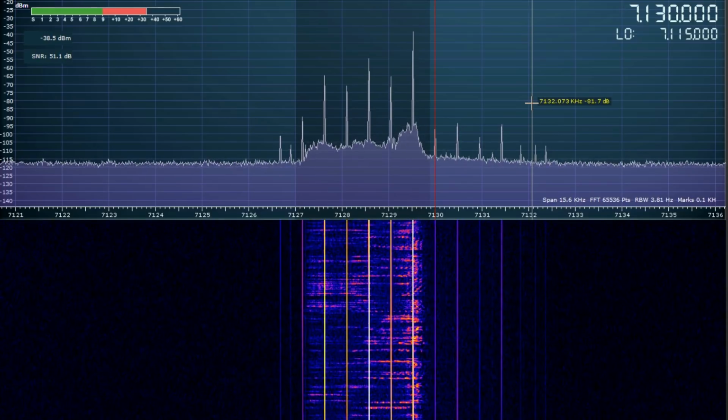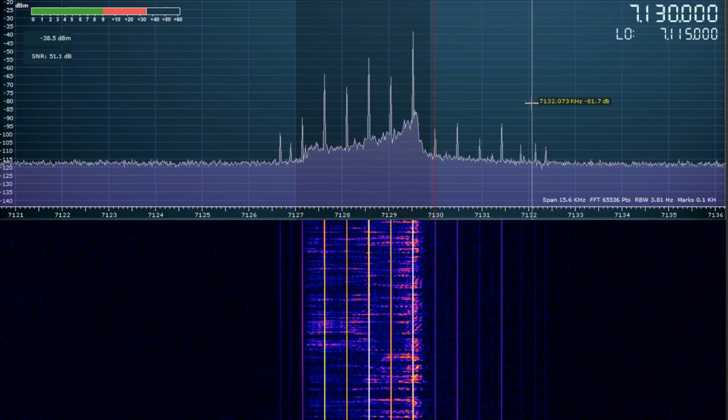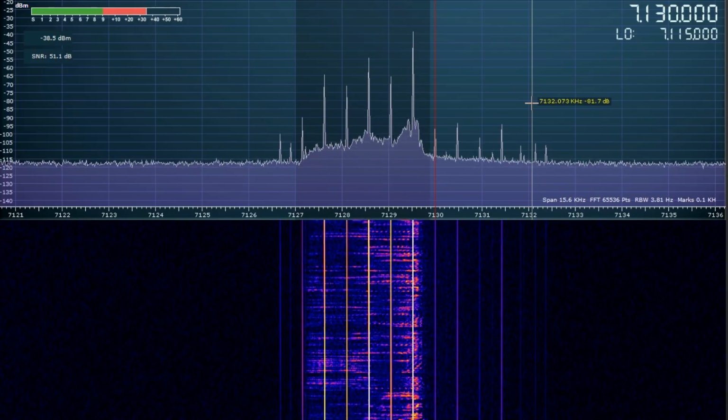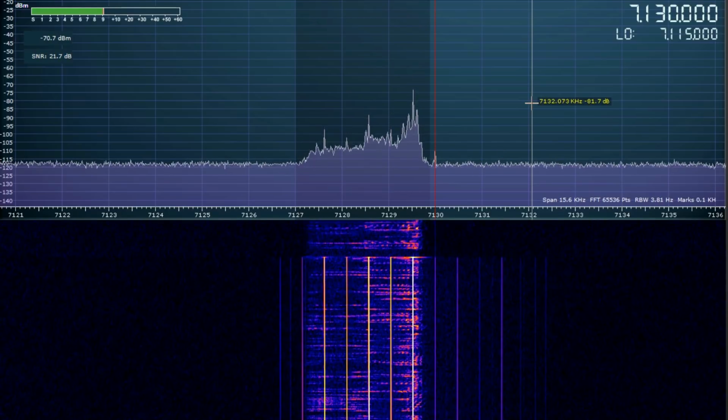Let me stop this for you. Now, it's important to let go of the down button first and then the push to talk. Otherwise, you might change your VFO frequency. So we'll do that now. Let go of the down button. You can still see it's picking up my audio, and I'll let go of push to talk.